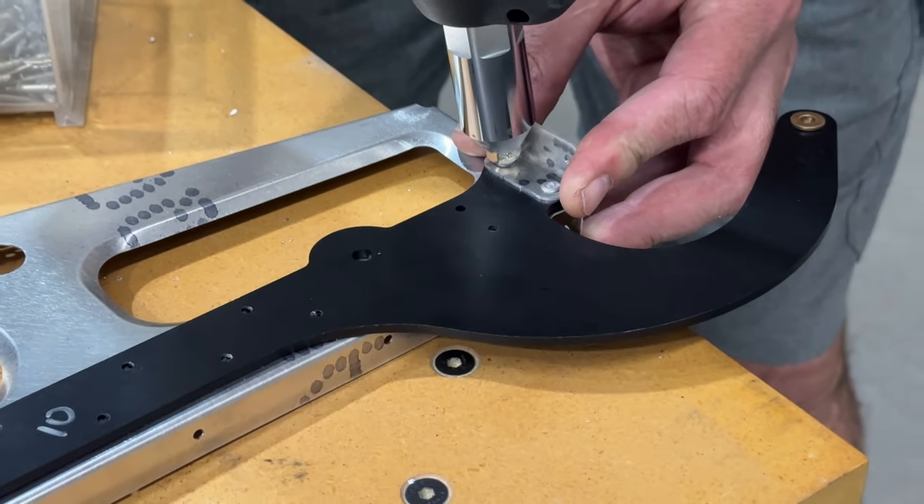I'm going to get the truss bolted in here. I've got my bore scope out looking in there and I think I can do it. The wrench I'm using is a long half-inch combo 9/16ths open-end wrench and it's straight. I wish it had a little more thickness to it, but because it's straight and flat, I'm actually able to stick it in there flat up against the spar.